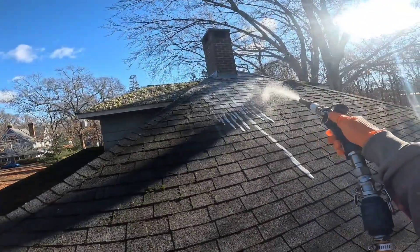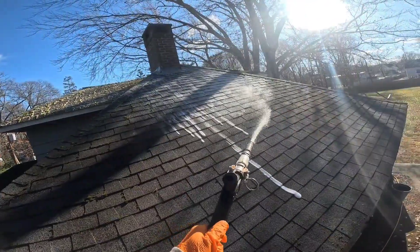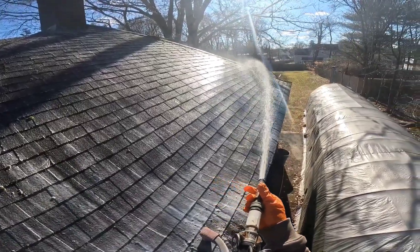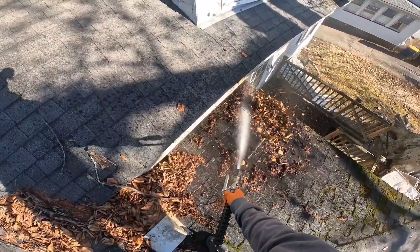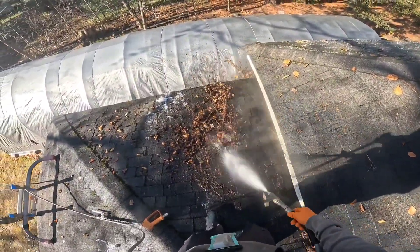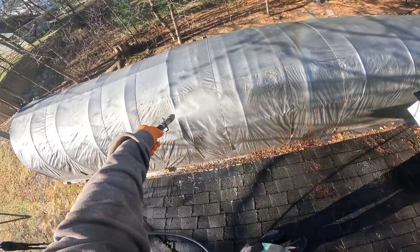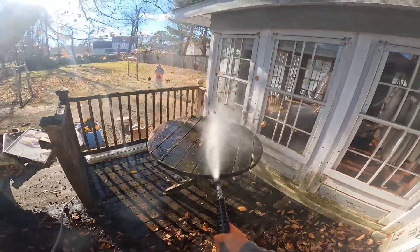And this roof here, it's not huge, but there's a lot going on — a lot of different peaks on it, and a lot of moss on most of it. Right here we just got a lot of black, we can see a lot of moss as well up on that dormer on the left. Then we kicked it back out back here, and a lot of buildup with just brush. And it's only 33 degrees out guys, so took the ball valve on the 8-gallon and kicked that off real quick. Shouldn't affect anything — we are using 6% SH, what you should always be using.